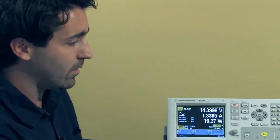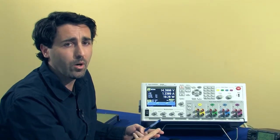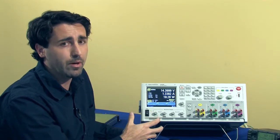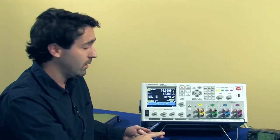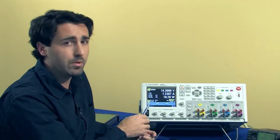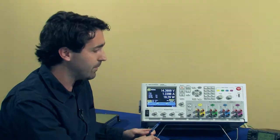So it's very important when you're testing something like this type of radio or a military radio that's going to be mounted inside of a vehicle and powered by a battery, or even military radios that are larger but powered by just a battery alone. You want to be careful about how much power is being drawn in off mode, in standby mode, and during transmit to make sure you get the most use out of that. So it's very easy to make these measurements with the new N6764A module that we're using today.